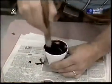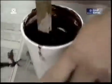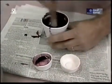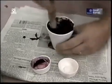Before I start my assembly, I have mixed up some waterproof glue. That might seem like an extreme, but I want to use this as a precaution so that this bench is going to stay together forever. It's a 2-part mix. There's a resin and a catalyst, and once you put the two together and mix them up, you end up with a glue, once it's dried, that's impervious to water, insects, and even chemicals.